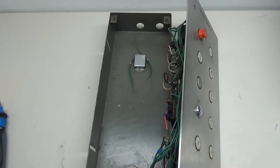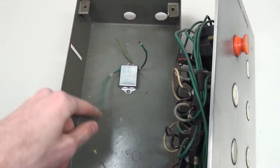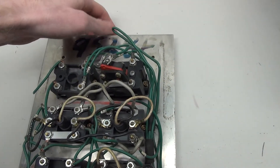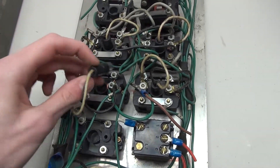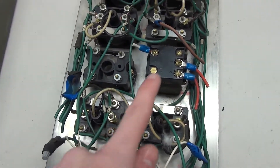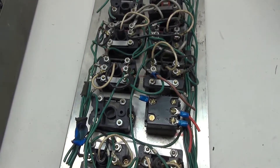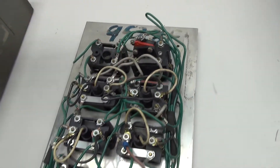So let's open this thing up and see what's on the back. Upon opening the panel we're first greeted with this buzzer — this was most likely the fire service buzzer. Back here we have all the guts for the panel and you can also see the broken stop switch here, which is very broken. Up here you have the typical armor base, these are the lamp holders with MB bulbs inside. Here's the key switch, and here are the Medeco keys that we'll need to replace. I'm going to remove all the wires first and then we'll start taking a look at each of the buttons and seeing what we can do with those.